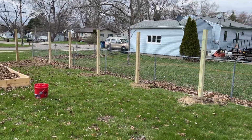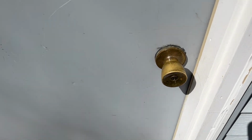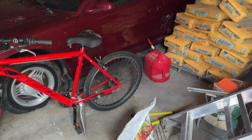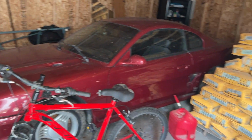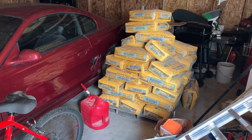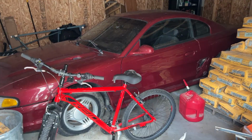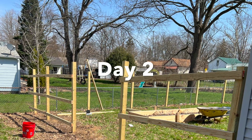The most important thing to remember though is to remove any contact with the ground that you can. Even if you set your posts deeper than 3 feet, you can still see them rot at the base. The 3 inches below the surface and the 3 inches above are the first place to rot on a post. We got all the concrete tucked away, and first day is done.